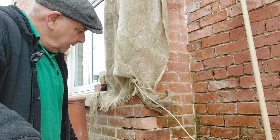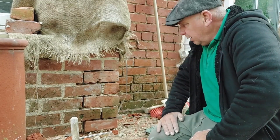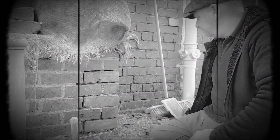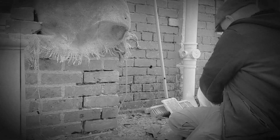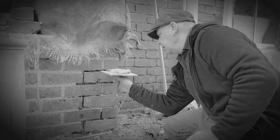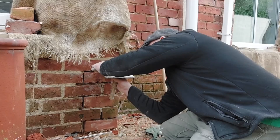So that's the corner back up. What we're going to do next is joint it all up with the old pointing trowel. If we were back in the olden days, this is exactly how we'd have done it — so it's no different today. The only difference is the material, which is obviously lime. We get our extremely thin trowel, just put it to the edge of the brick, and carefully fill that joint right to the back with your mortar.